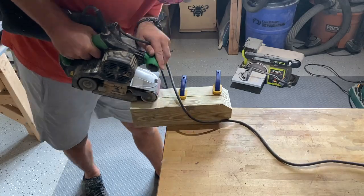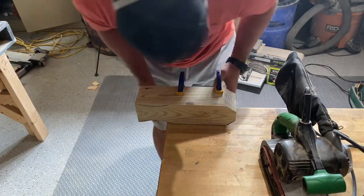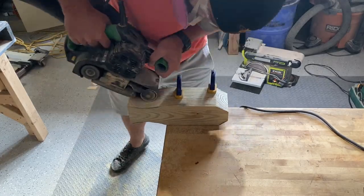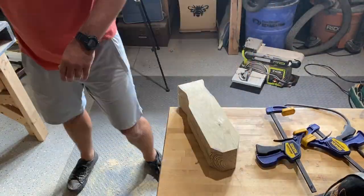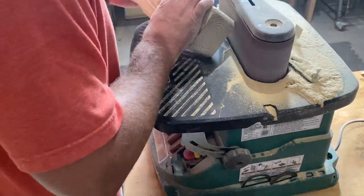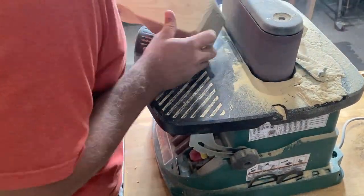Now for the legs in this 4x4, you really needed to go heavy on some grit here, and I found that the belt sander worked much better than the stationary sander. So I began shaping it with that, and then I moved back to the stationary sander to really round over the edges and curve it the way I wanted it. I kind of used this sander almost like you would a carver.